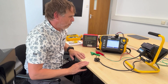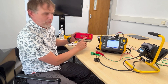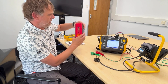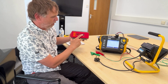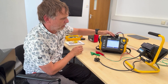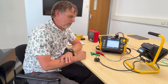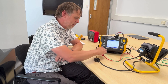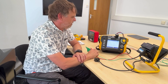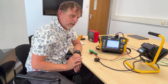First of all, we need to make sure that we're on the right COM ports, and these do differ. On the Robin Amprobe, the red port is our main port of utilisation, but also the blue port, which you can see properly labelled there with COM. Slightly different on the Chauvin - while that still uses the red port, the COM port on this instrument is the green port. For our testing today, we're going to be using the red and green lead. The 6117 is set up for resistance and the first test is going to be a continuity test.